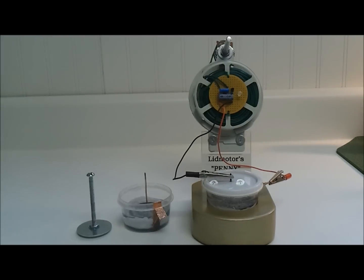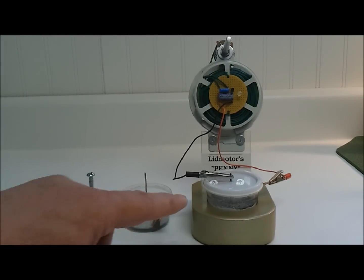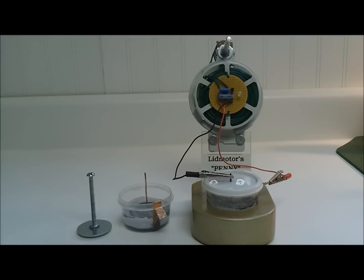This cell running this circuit will run at about three-quarters of a volt, and anywhere from about 15 to 50 micro amps — not milliamps, micro amps. So that's a very low draw.